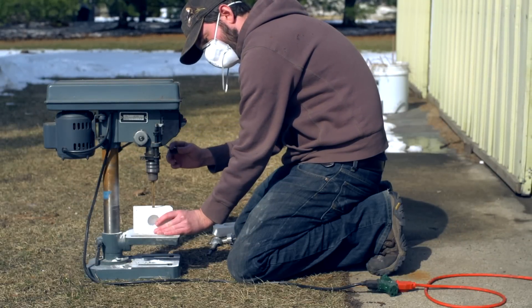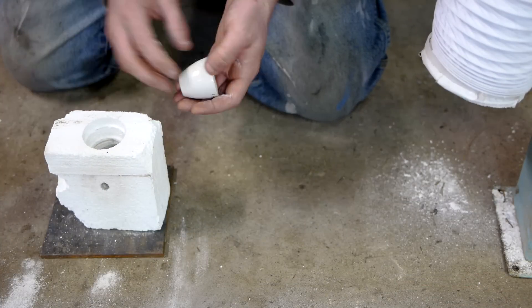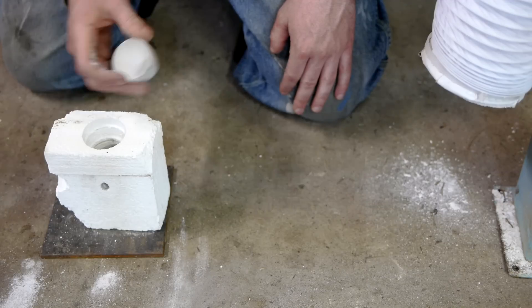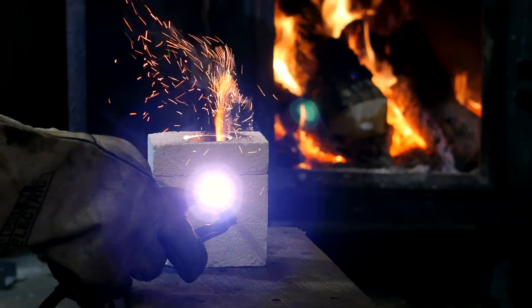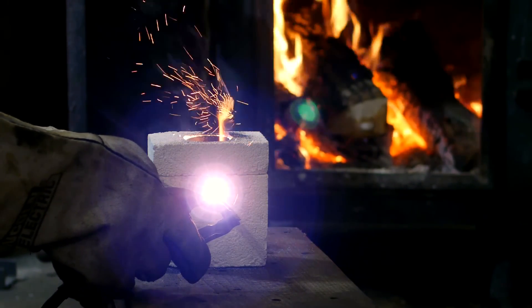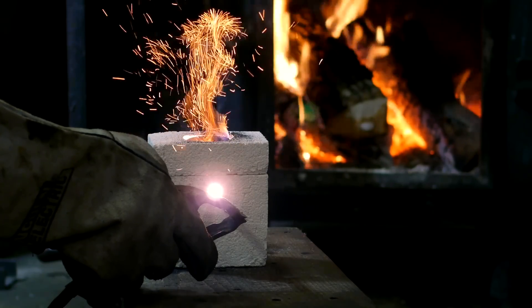You can find a link to his video in the description below. The biggest change I made from Grant's design was to drill a hole into the top of the furnace to contain a ceramic crucible, which I will use to hold my potassium carbonate and charcoal. An arc welder is the power supply used to heat this furnace, and the graphite electrodes are one of the few materials in the world that can withstand the extremely high temperatures created within. Inside the furnace, an electrical arc creates a superheated plasma which heats the ceramic crucible from below.